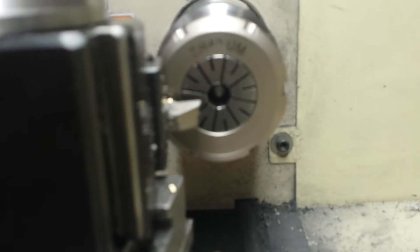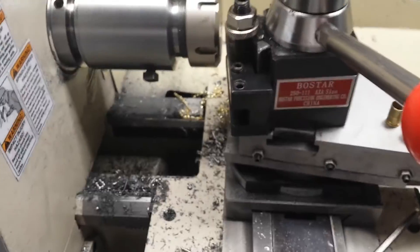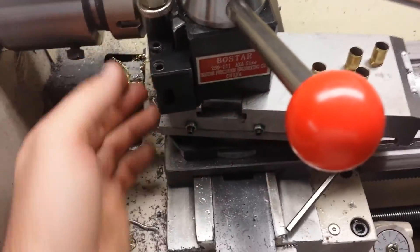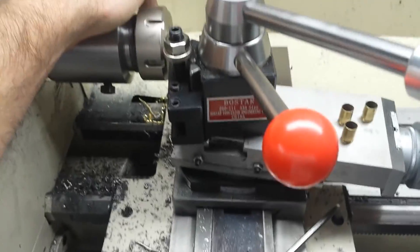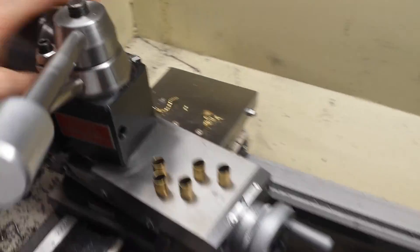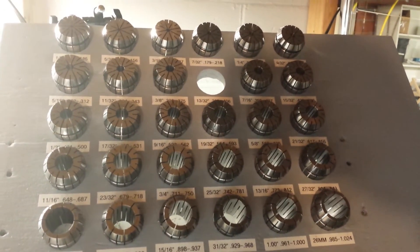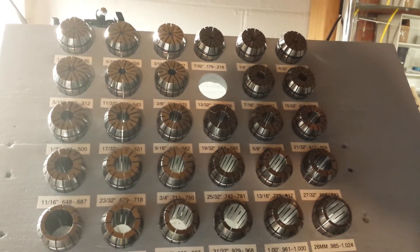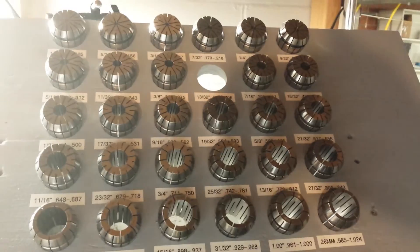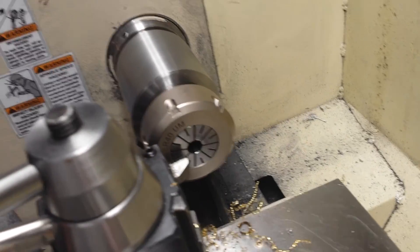Take a closer look at the stop in there — that's fully adjustable. You can trim and check, and then you can always advance your compound rest towards the chuck if you want to cut them shorter or longer. Doing it on the lathe with the ER-40 collet chuck is definitely nice. There are 30 collets that get you just over one inch, starting at 1/8" up to 26 millimeter, which basically gets me to 1 inch and 24 thousandths — so anything in between it'll grip. And that's all there is to it.